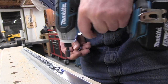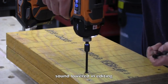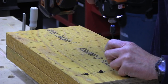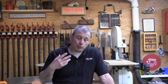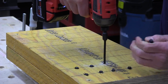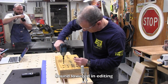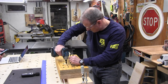The last performance test was timber locks driven into LVLs. Manufacturers position these oil drivers as quieter, gentler impact drivers best suited for occupied spaces, but we wanted to see how well they handled heavier loads like headers in remodeling projects. We drove four 5-inch timber locks into two LVL pieces, recorded peak sound from a foot away, and took averages with all three drivers on their higher settings. The result: RIDGID was the fastest, Makita was the quietest, and RIDGID was the overall winner of the performance speed test.